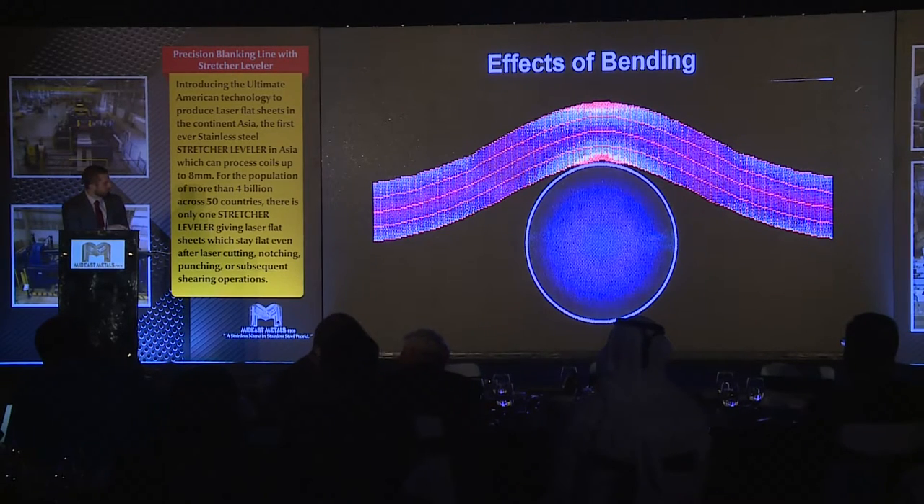We're doing a lot of work on the outer edges, but in the middle strand there's no work being done. The problem with that is if you laser cut the material and there are trapped stresses in the middle, that's where you'll get the spring back.